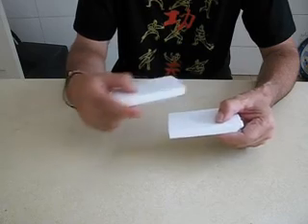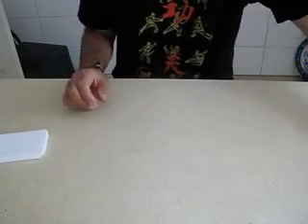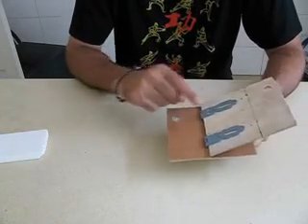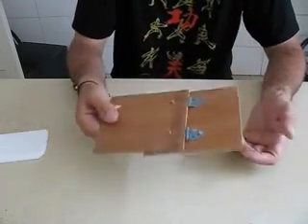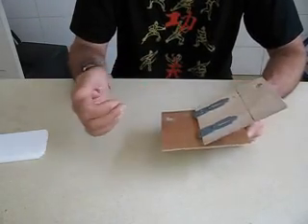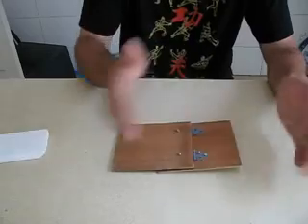To hold it into place, I would place a magnet here on the back piece to attract the hinge itself. So this is my little prototype — two hinges here, a magnet here, and the hinge extends down so it's attracted and held in place. Very strong in this direction because of the extra material here, but easily collapses in this direction. If you have some long panels, when you collapse it you're saving almost half the length of the panel.